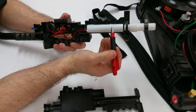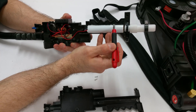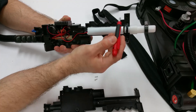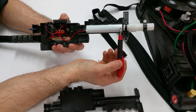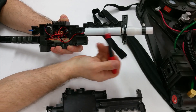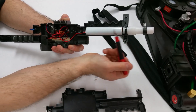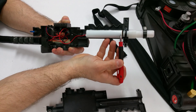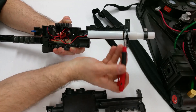That allowed me to tune the focal length of the laser and then lock it into place. The problem is these two-watt lasers get really, really hot and would melt not only the hot glue but would melt through the plastic if left on too long. So this metal tube solved two problems. First, it keeps the diode stationary inside the tube — the diode is only about this wide, and the longer the tube, the clearer line of sight and alignment, since the diode is coin-shaped. Second, it wicks off heat through the copper shim down through the tube, so this never really gets all that hot, won't melt the glue, and won't melt the plastic.